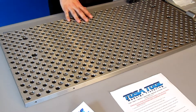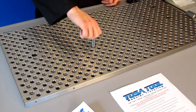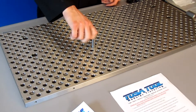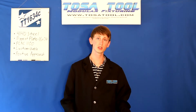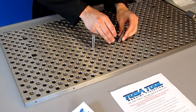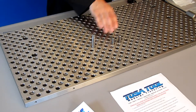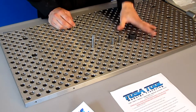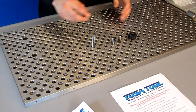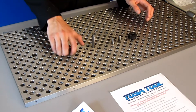You can also use these holes for precision locating pins that thread right into the holes. The half inch precision bored holes are used for precision dowel pins that slide right in, or standoffs that slide into the holes, or standoffs that thread into the 1/2-13 threaded holes. I'll talk about these in another video.